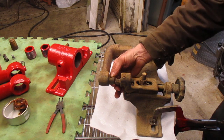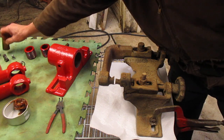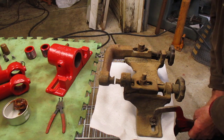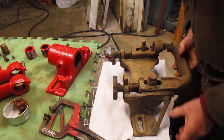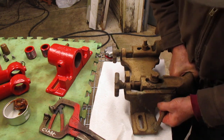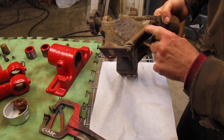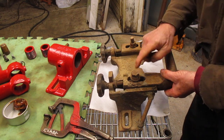Number one, these pieces here are supposed to look like this — they're supposed to be made out of locust, from the best I know, and that's what those are. I've got it clamped down right now. This has all been brass-welded here to make it stronger because it looks like it broke off. They're right heavy. You can see where this has been added on here — this is all bronze that somebody put on there because it's cast iron. All this weld through here, I'm sure that's all bronze. They added that, I guess, for strength.